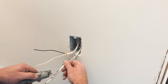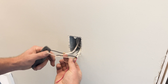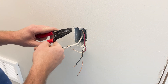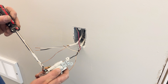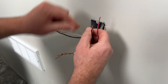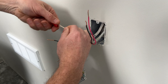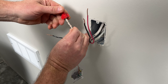The connection for the white neutral wires and the ground wires in the electrical box are straightforward, so we'll start there. Twist the ground wires together first, and cut an additional 6-inch ground wire to connect to the green terminal on the switch and twist together with the other two grounds. Then connect the white neutral wires together with a wire nut — use the right size, twist until tight, and give it a couple more twists to ensure a strong connection.